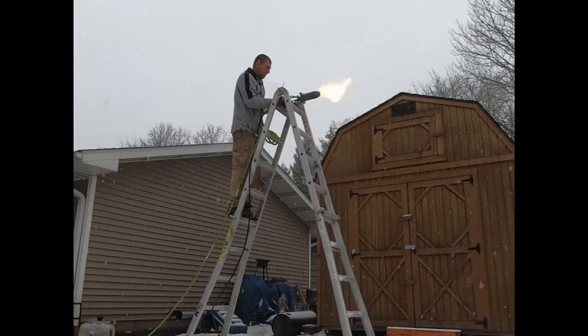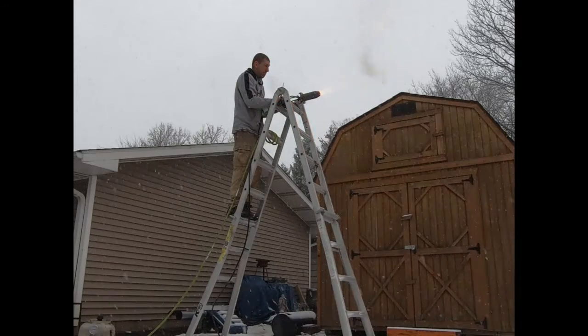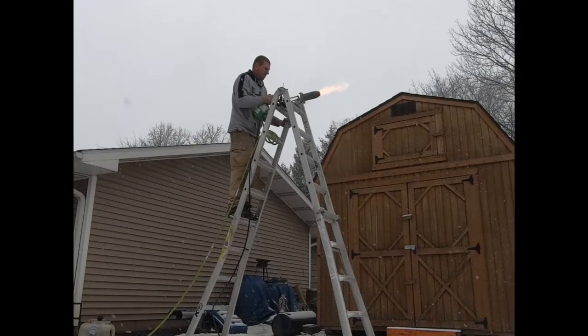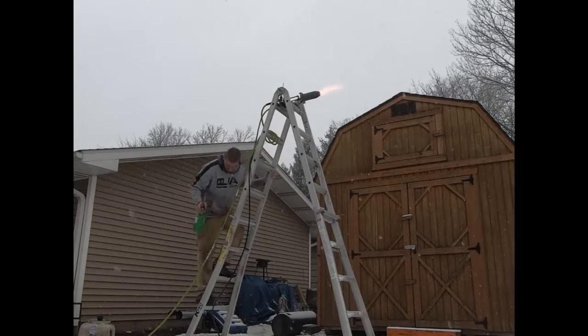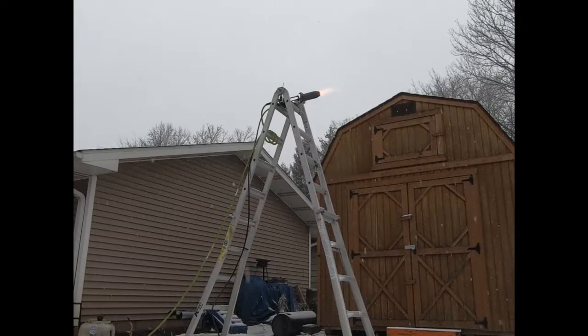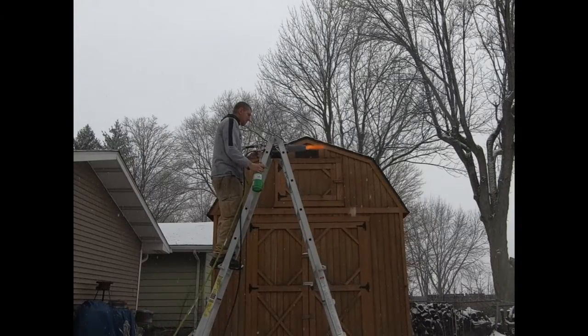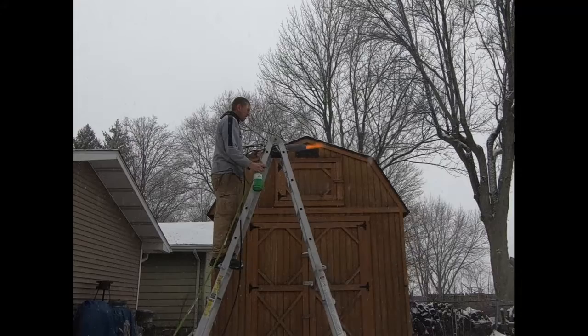I'm having problems with my air compressor right now, fellas. I'm in the middle of a blizzard and I don't have a desiccant canister hooked up at the moment — I thought I'd try it without one, but things are still a little froze up on us. This thing can do a lot better than what we're going to see in the video. I just don't have time to dial this thing in, Phil — I've got to get to the post office at a reasonable hour to get this thing to you in the morning. So we're just going to be seeing a quick proof of concept here to show that the pump does in fact get the oil up high as we're ever going to need it. If we can get this thing up to 50, 100 PSI, it doesn't matter. I don't want to get this thing glowing red hot — I'm afraid we'll crack it. This is silicon carbide and it's similar to porcelain, so if it gets really wet when it's really hot, it will crack. So we're also going to want to build a rain shroud around the top of these things.